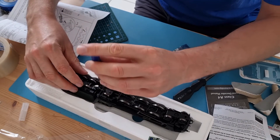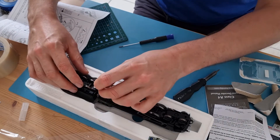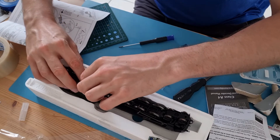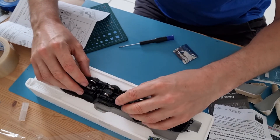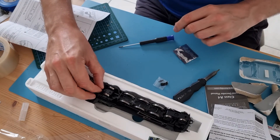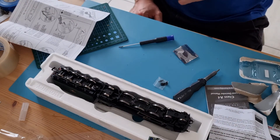What we'll do is secure the drawbar - it has a tiny little washer as well. Those are quite nice; they're a shouldered bolt so that whenever it's tight down, the actual bar still lifts. Just when you tighten it back, obviously you need to make sure that you don't nip the side of the hook with the shoulder. But that gets it there. So we'll take it up and see what it sounds like.